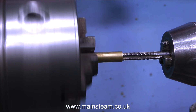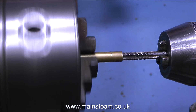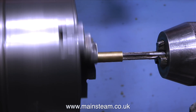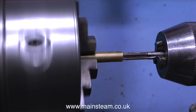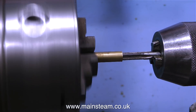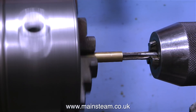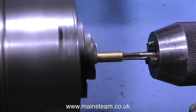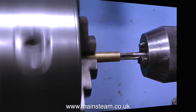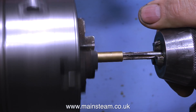This clip shows the threading operation. I engage the back gear of the lathe to slow down the rotational speed of the chuck, and here, as you can see, the threading operation is well underway. When threading holes like this, it's a very good idea to drill the hole longer than you need it so that the tap doesn't bottom out at the end of the hole and snap off. Once the hole is threaded, removing the tap is very simple.